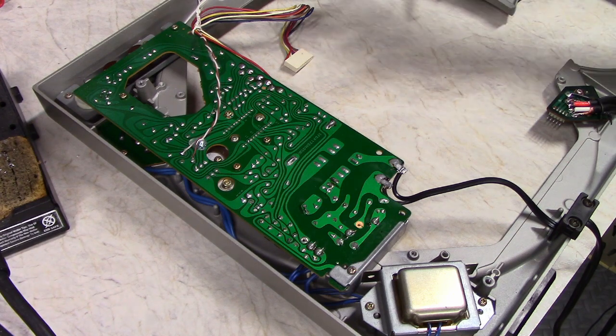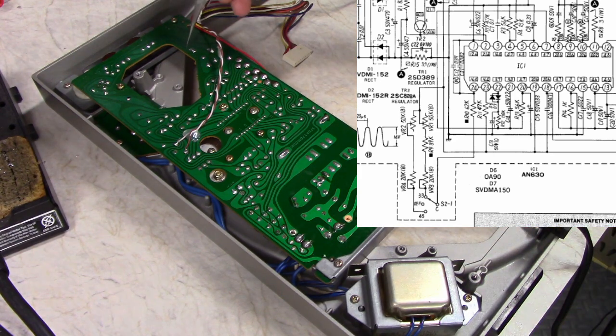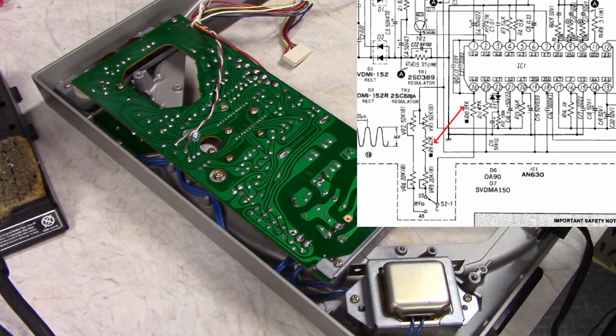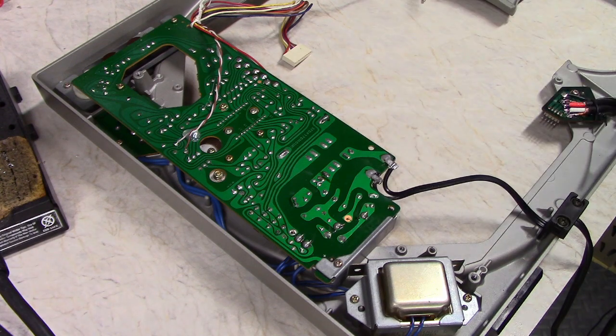If you want to do this mod so that it only affects the 45 RPM speed and not 33, it's technically possible though a little more complicated. What you can do is physically swap R9 with R10 — desolder these two resistors and switch them around. That will not affect the 33 RPM speed at all, but it will change the 45 RPM speed, making it go faster, which you'll then have to adjust back down using the trim pot. The idea is to add as much resistance with the 50K trim pot as you can, then put the switch in parallel with that trim pot to get the 44K out of the circuit. But honestly this is too confusing — just go with the easy route: put the switch across R10 and put about 25K on the switch.